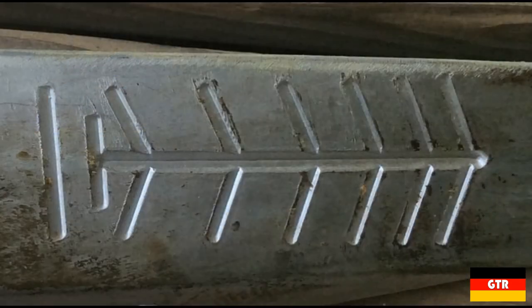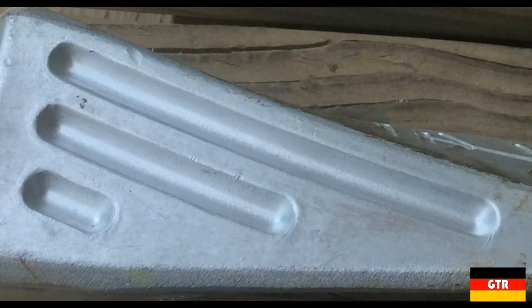The angled grooves cut into the wedge are supposed to prevent spring back. These appear to be done post-casting with a stamp. The larger grooves near the top of the wedge appear to be milled, but also could be part of the casting and cleaned up with an end mill.